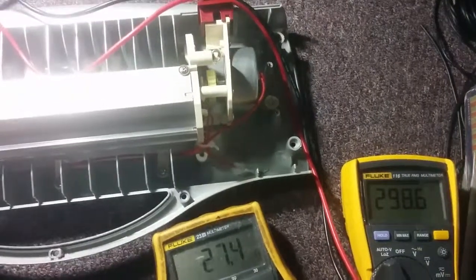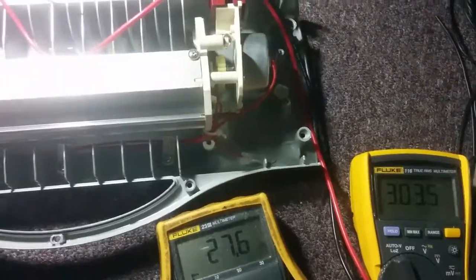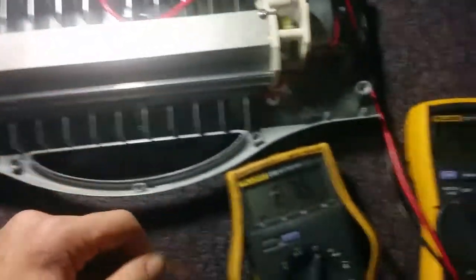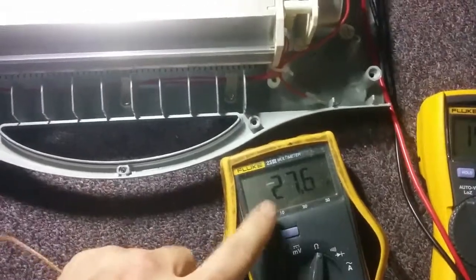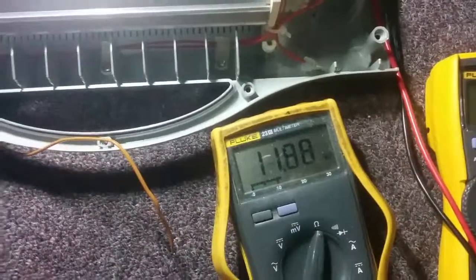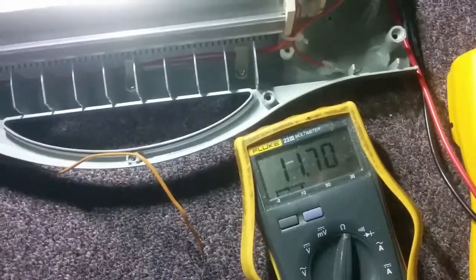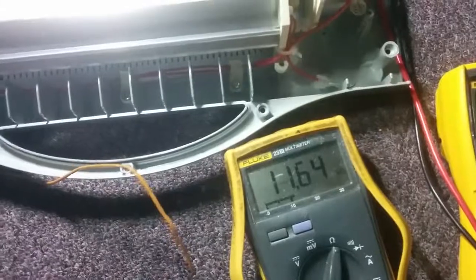Now you see it's already at 300. When the case was on, it would beep for sure and indicate that it was finished. Got the double beep — and we're going to have the green light. So this goes to 306 — 305, 306, thereabouts. The resistance is not actually drastically changed because the logic of the microcontroller is interfering with it. When we remove power, it bumps up to 12K. So the microcontroller resistance is definitely interfering with the thermistor resistance in the sense of our reading, not in the design of it.